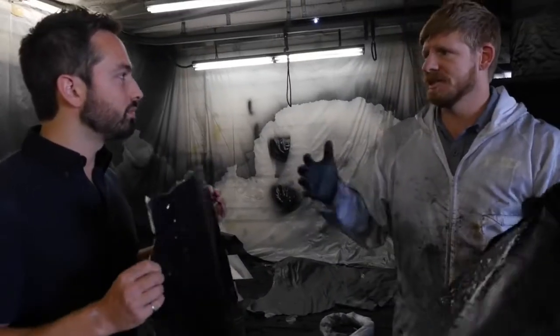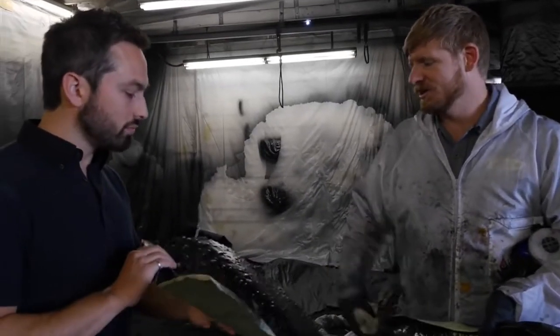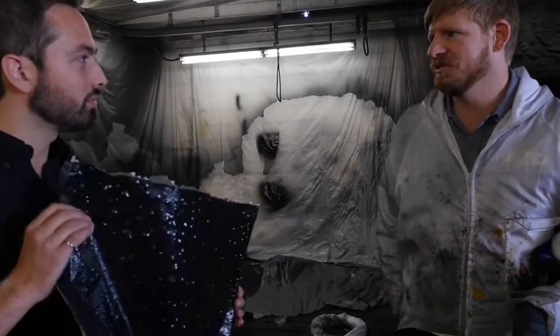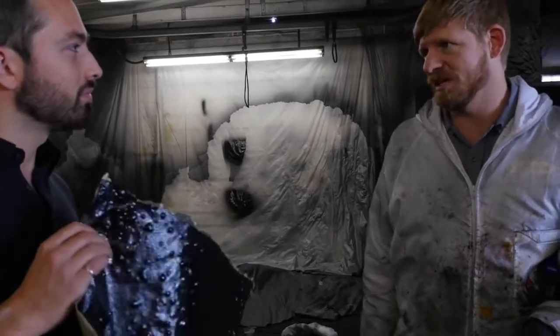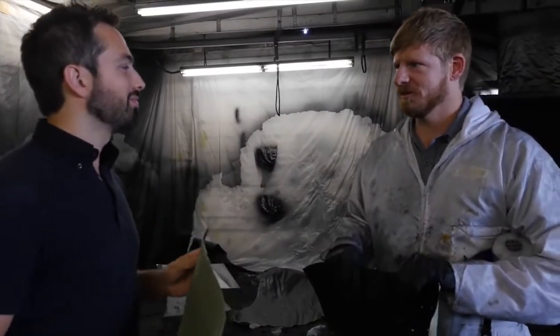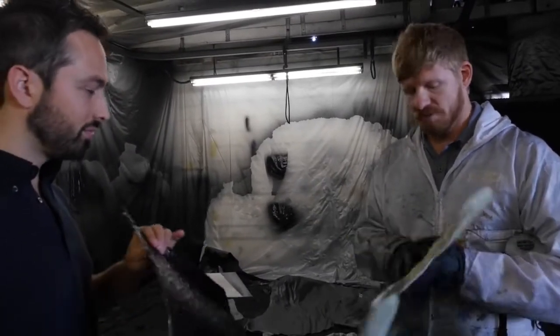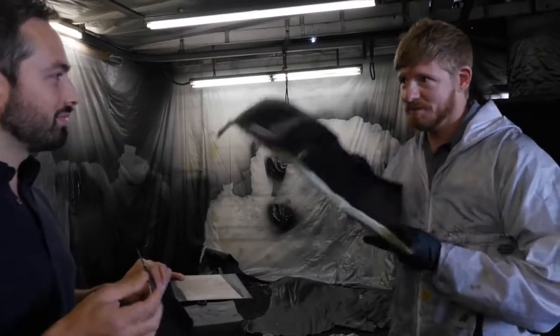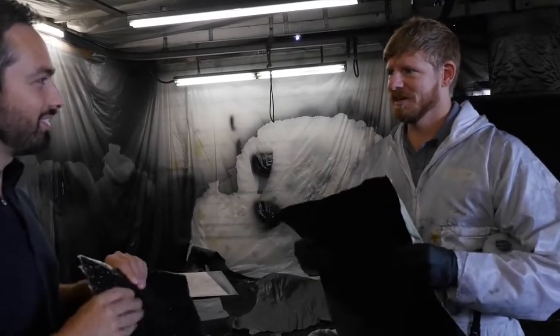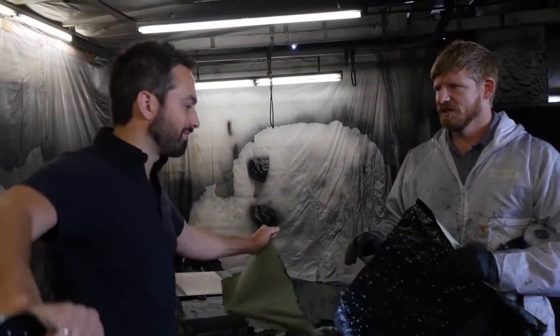Those two chemicals just keep looking for each other, or looking for something, so to speak, until every last molecule's found a home or given up looking. And that could take a day or more. But there's plenty of opportunities to crosslink right now. So that's what it's doing, and that's where all the heat's coming from. Right. So it's already dry. I'm not going to get any on me. Yeah. It's already cooling back down. So we've done the vast majority of curing and cross-linking.